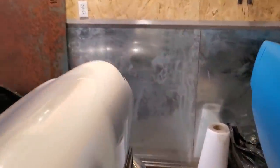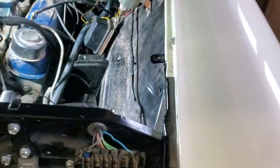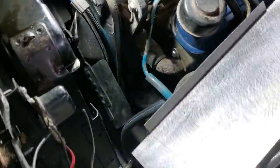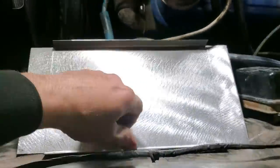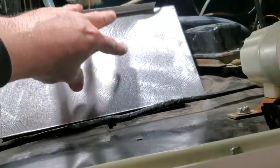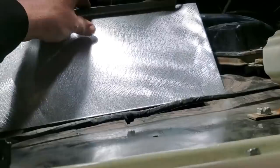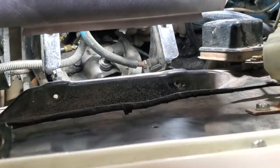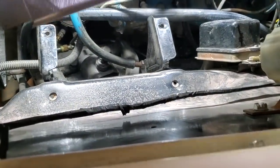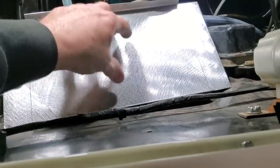Tight squeeze. Now, as you can see, that's where that'll lay like that. So now I got to drill 4 holes in this here to line up with them 4 holes there. So I'm going to go over on the bench now. I'm going to measure these up and drill 4 holes in this and just have that done, so then I know where it's got to mount to.